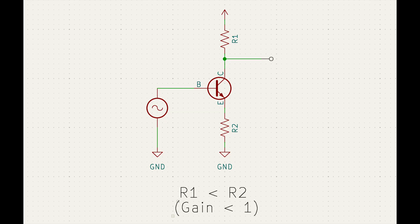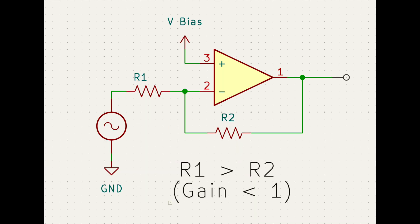You might think: okay, I'll do something fancy with an op-amp or with transistors. Like I'm building a preamp anyway, so maybe I should just include the option of having less than unity gain and reduce the signal that way. But the short story is that you end up running into all the same problems again — you just kind of push them back a stage. Either the voltage is too high, or you're trading off noise, or some kind of filter.